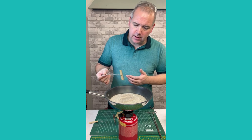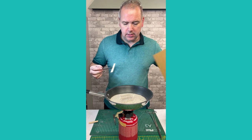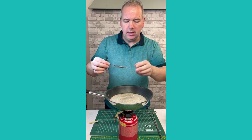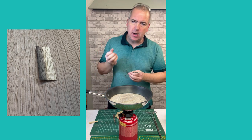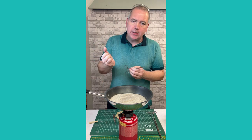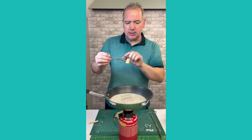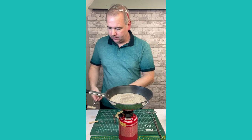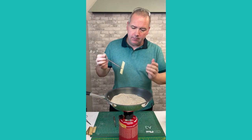See the smoke coming off then? Make sure you've got no fire alarms going on around you. Like so. And look what's happening to the wood. It's curling up. This part of the wood here is drying up. The moisture is being evaporated out of it. It's been leaving the wood. And that's what happens. It starts to contract. It starts to get smaller. And as it goes smaller, there's less water here now than there is there. So the wood shrinks.